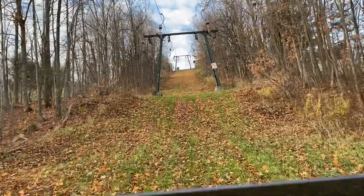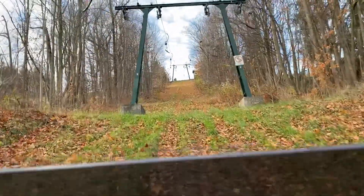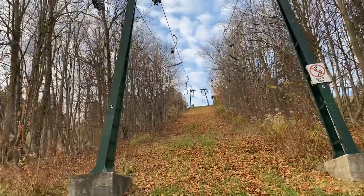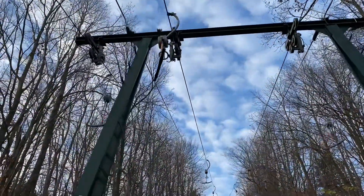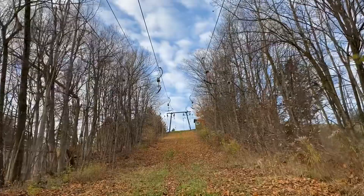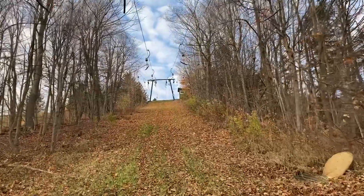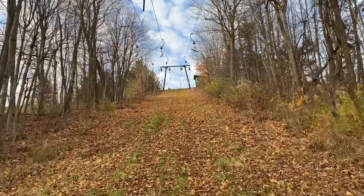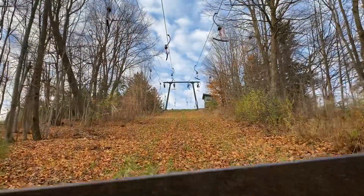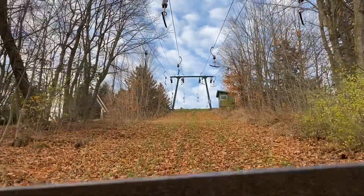What's going on with tower four here — we have the rope riding on the inside. I'll have to get that fixed up. You can see it's riding on the inside, so I'll go back and fix that. The alignment on this lift is quite good overall, but when it's de-tensioned it has a tendency to throw itself out of alignment a bit. That'll just involve prying the haul rope back into the center of the combination sheave. Should be good — I'll get the tractor out; thankfully it's relatively dry right now so we have a chance of getting up there.